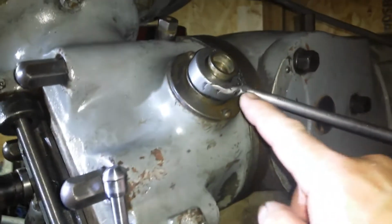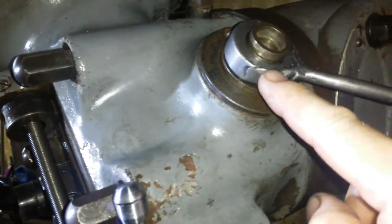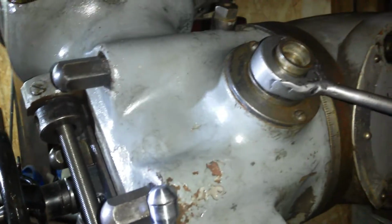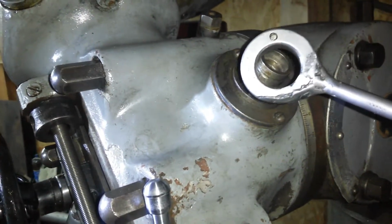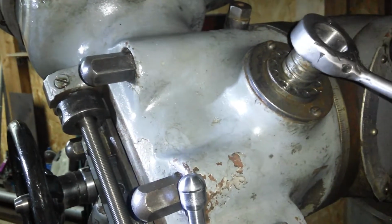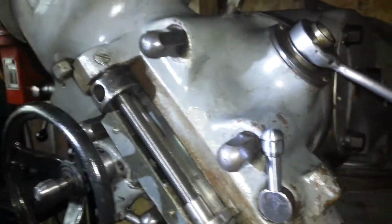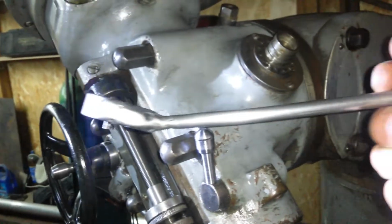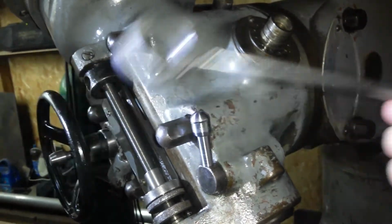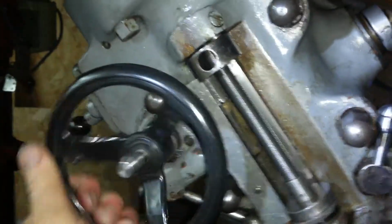Quite happy with that. And I re-welded this. This was pretty pathetic, but in the rebuilding of this area here with weld, just to make it look slightly better, it is better, I had to rebore it because it was out of square after it. Look how much is missing off of it, and I've had to have that built up by twice its thickness. So that pulled it out of kilter, so I bored it, and now I need to bore it more and sleeve it, but not to worry. I've straightened the kinks everywhere, so I'll straighten that out as well, which, well, it's almost straight now. It looks pretty much how it should look now. So I'm quite happy with that. Get in there. Only problem I'm having is, right into gear, listen to that, it locks.